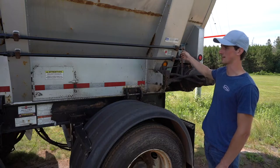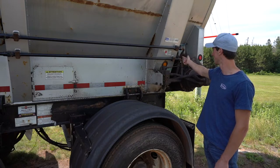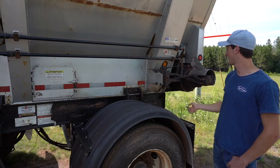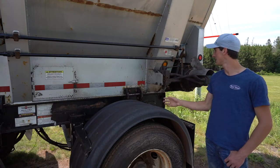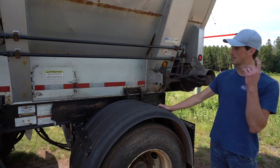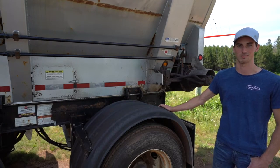The first thing you want to check for is oil leaks on the hydraulic system. You want to check all your fittings on the steel end and on the rubber end, just to make sure there's no bad oil leaks. Obviously on an old trailer you can expect some residue, just like this one — that's normal. But you don't want to see oil dripping anywhere, or rips, cracks, splits, or anything like that. The hydraulic system runs on very high pressures, so it's a good idea to keep this in good shape.